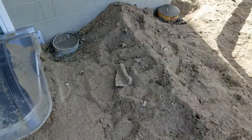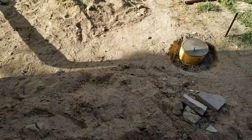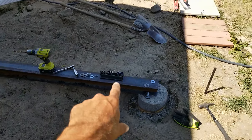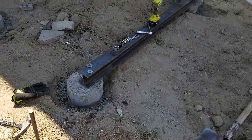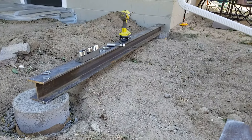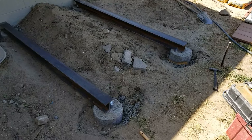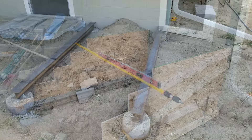The vertical load of these concrete stairs will be extremely heavy. Because of this, a side support will be necessary to distribute the main weight of the stairs to each corner pier. For this I'll be using two H-beams that are three-eighths of an inch thick, spanning from the back pier to the front pier. For the span going side to side I will just be using rebar after the forms are in place. Here's a look at the beams after securing them to the piers — I now have a foundation that will support the weight of the concrete stairs.